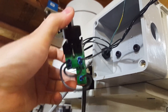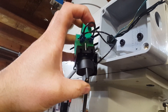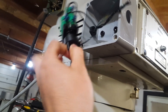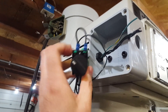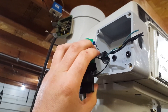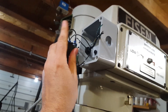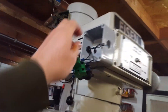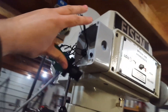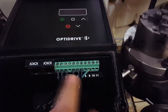Now you can see this wire labeled 'one' — that's powering all the switch terminals. This wire labeled 'two' comes into the other side. When I flip it this way, pins one and two are touching — that's forward. In the middle position, nothing's connected — stopped. Flipping the other direction keeps pin two connected but also connects pin three into pin one, so all three are connected together, which switches the direction. That gives you forward, off, and reverse.